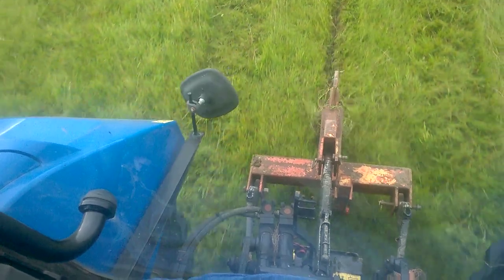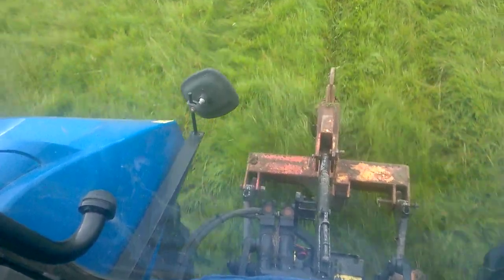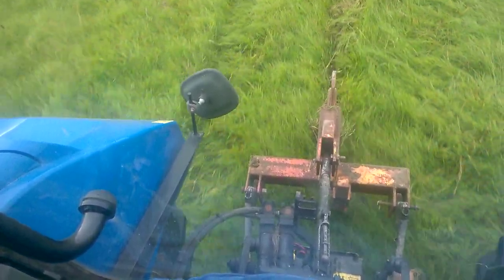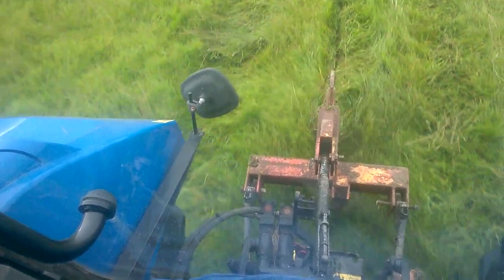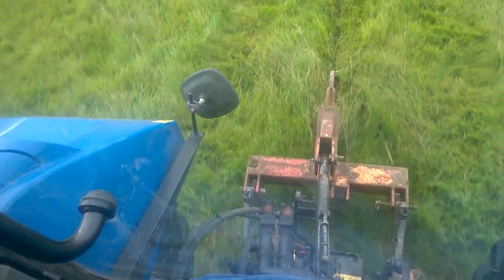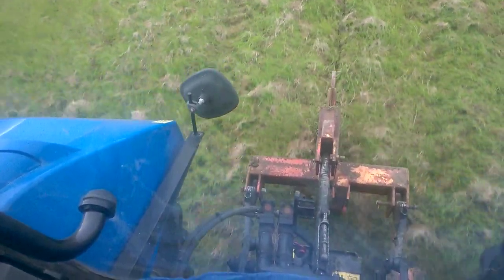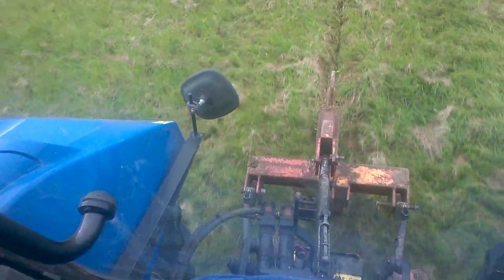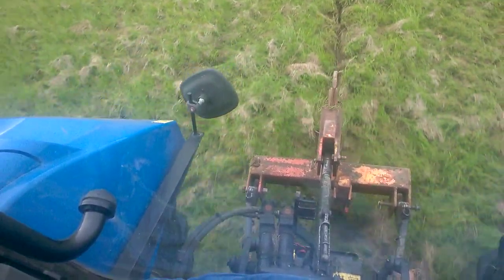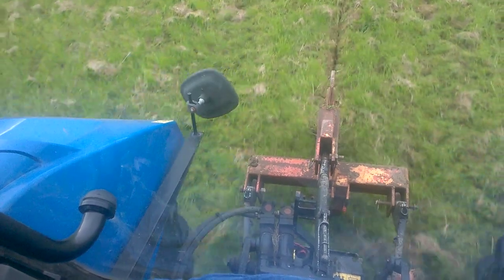I'm doing 7.2 km/h, something like that. I've got the mole plough actually kicking up at the back — basically it should fracture the ground quite well, and you'll see the ground heave in behind me. That's what you want. The heave basically brings up the pan that's on top and hopefully shatters it. So come the winter time, all the water that's in here should disappear. And the easiest route, which should be these lines — if I've done the job right and it's cracked the pan at the top — it'll also help it drain off well.